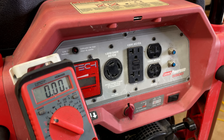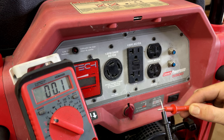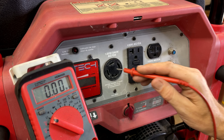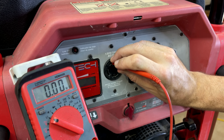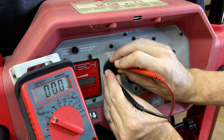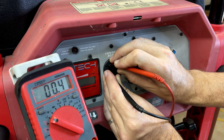Before opening the power head up, let's do some tests. It's not a conclusive test, but it'll show if there's something obvious like an open circuit or really high resistance. Set the multimeter to measure ohms and check the resistance of your leads — in my case it's 0.1 ohms, so I can subtract that to get the true value. Starting with the 240 outlet, one probe in the neutral and another in one of the legs. Usually on a generator this size the reading should be about 0.3 or 0.4 ohms. In this case we're at 0.4 to 0.5, subtract 0.1 and we're at 0.3 to 0.4. So that is good.